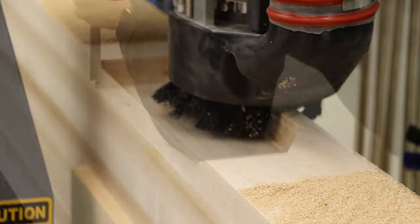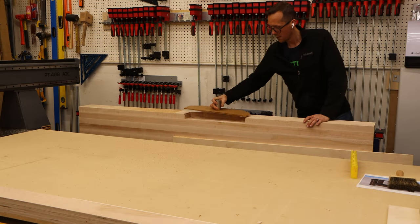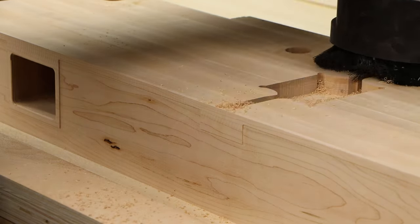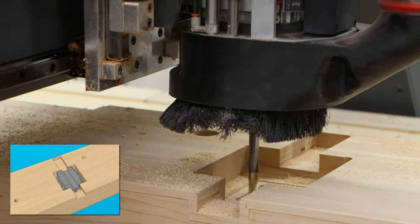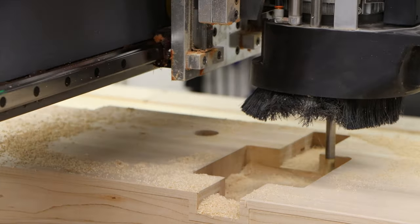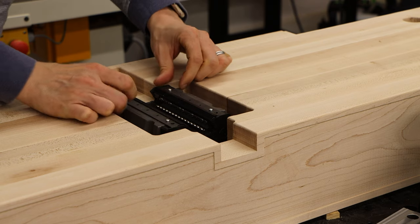I flipped the slab over so I can cut a relief in the opposite side, because I want the vise to sit flush with the edge face. Now I'm using the smallest Twin Turbo vise available, because I wanted it to also be flush with the bottom of the slab. Once installed, there's about a half inch of solid wood left above the vise. Now the sides are done and the slab can be placed bottom up. Recesses have to be cut 2.5 inches deep to carry the carriage for the linear rails. The carriage will allow the slab to sit exactly 1/16th of an inch above the base. So the milling needs to be precise — perfecto, dead on, money, you get the idea.